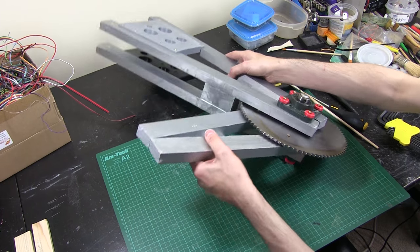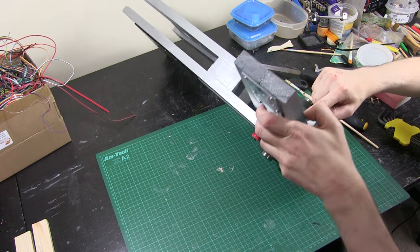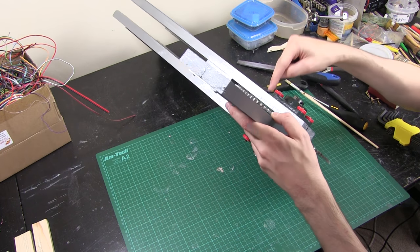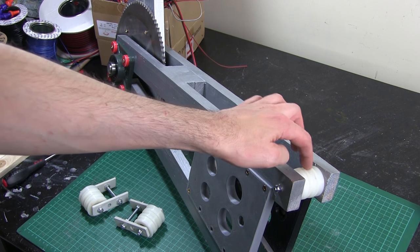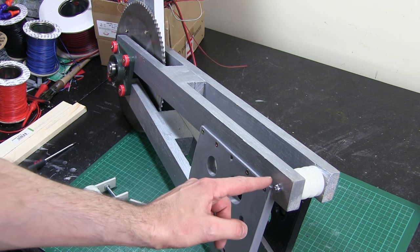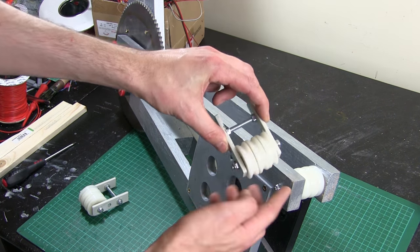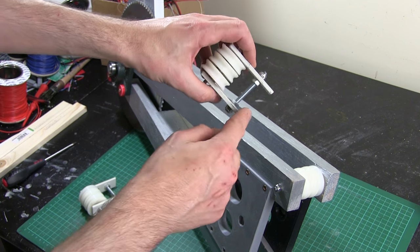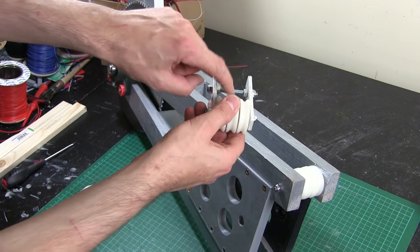I realized they needed some spacers so that the sprocket can go around the chain and grip on both sides. I've put some little spacers in so now I've got just about the same amount of space on each side — this whole thing is mounted pretty much in the middle. I've printed and installed more pulleys — three in here and they all move independently on their own bearings, mounted on a steel piece of 6mm studding. Eventually I'll put metal plates on the ends to spread the load. I've also made the opposing pairs on bearings. These go down here on steel brackets with another piece of 6mm studding. The chain can be wrapped round and bolted to itself, so that pulls against these, and the other end goes round the big sprocket at the bottom.